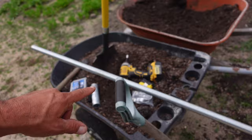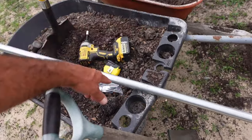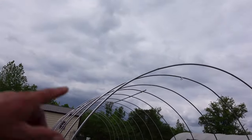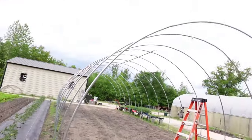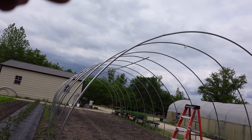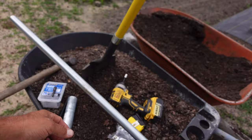Before we put this up I'm going to take the tape measure and measure down — so that's an inch and a half. I'm going to measure down probably four feet and make a mark. That's not going to be right because there's an inch and a half sticking out up here. So what I'm going to do is measure two and a half foot and make a mark, and that should put me where I need to be. If not I'll pull a tape from the center line before I get ready to set them. But really what I want to do is get it in here and kind of get it hanging so I can take this coupling.